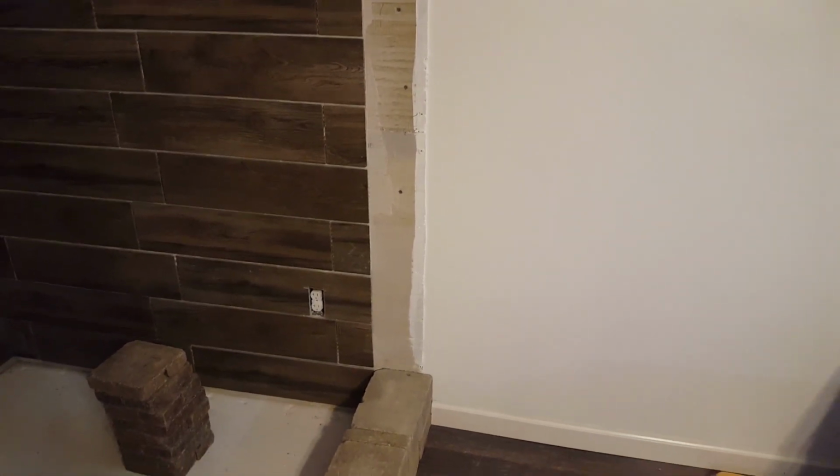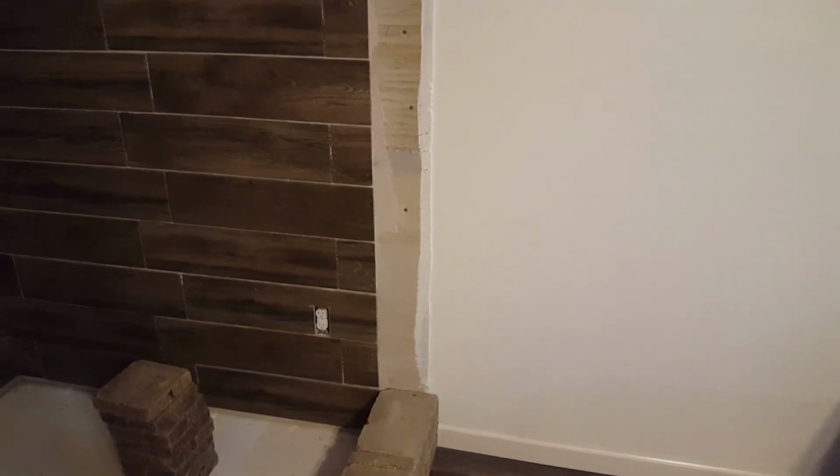I already covered it with paint, but I'm also going to put some tile adhesive along the edge of that cement board. So that way, behind this pillar that's on each side, you won't need any trim or caulk or anything going up the side of it, I hope. We'll be able to just have a nice edge there that you won't be able to see underneath it. So that's the goal anyway. And so let's go ahead and get started gluing this all together, and we'll see how it looks.